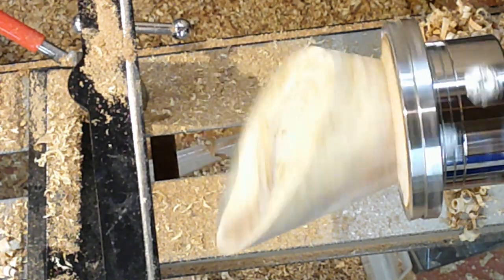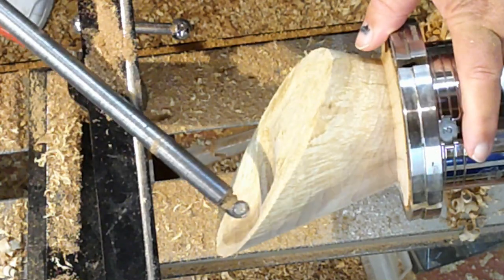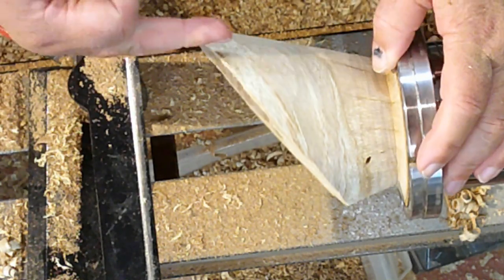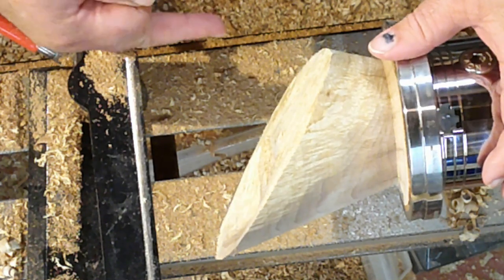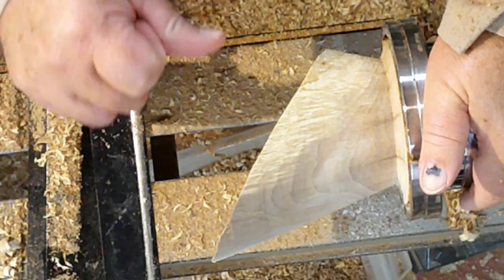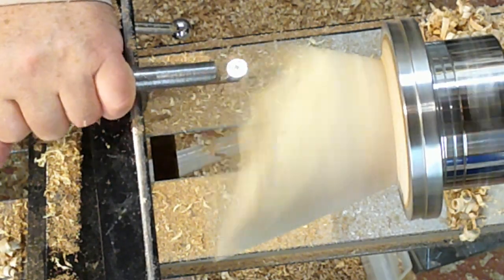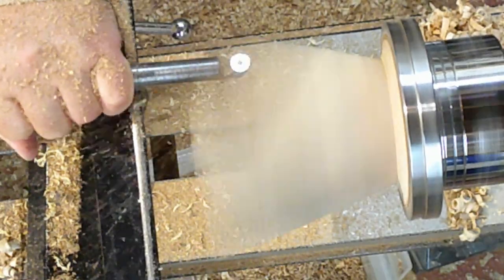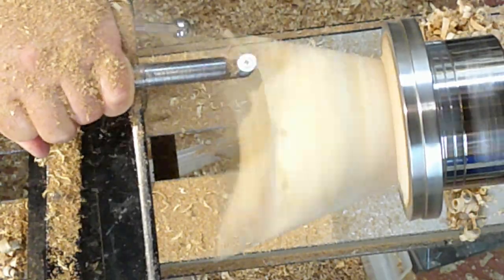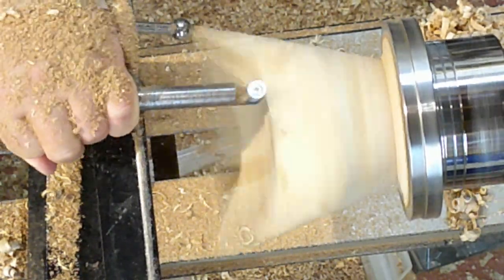And then I got some of those cutting tools off the internet. I think I paid £20 for 12, for those 12mm round cutters. And then all I did was drill a hole in the end. I tapped a thread in there, and then put a countersunk screw in the end. And then just ground the metal away on the end so that my cut could go in. And I have to say, they do work very well. I was quite pleased with them.